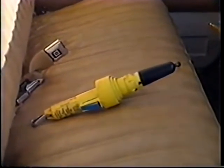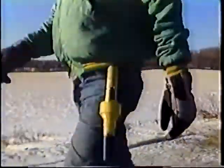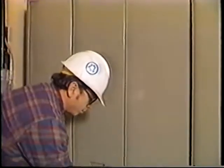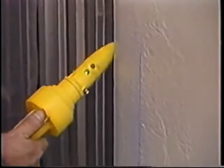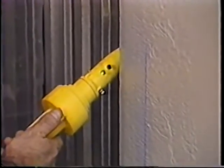Electrocution doesn't cause minor injuries. It kills. And it only takes one careless contact. As simple as it looks, the 188A is a very effective preventative tool. The 188A was designed to measure the difference between the voltage in your body and that of the object you are testing. When used properly, danger is indicated by a flashing red light. A safe object is indicated by a steady green light.